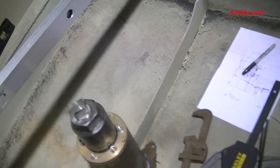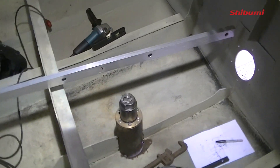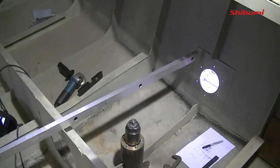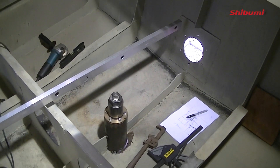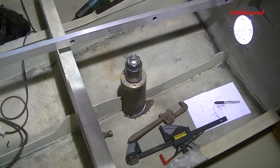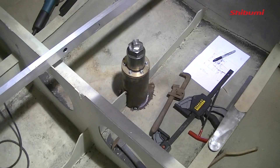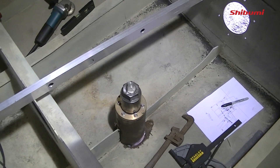I made reference yesterday to someone being mentioned in the video. As it happens, the stem of the rudder — because it is under the two back windows of the cabin and I am much lower than the floor — will end up being under technically the dressing table that will be in this cabin. Which means, should there be a steering failure, we will have to take everything out of that press, maybe, and connect in an emergency tiller into that square that is on top. And that is how we will steer the boat should the steering have a failure.